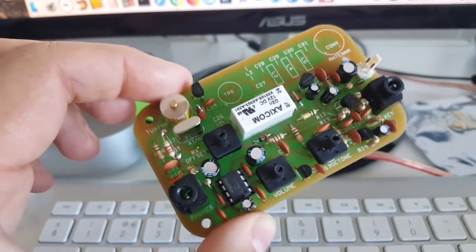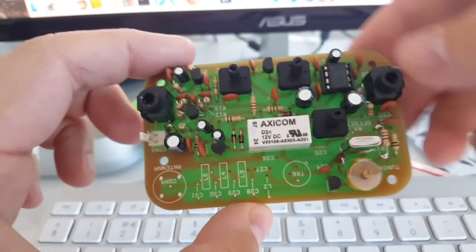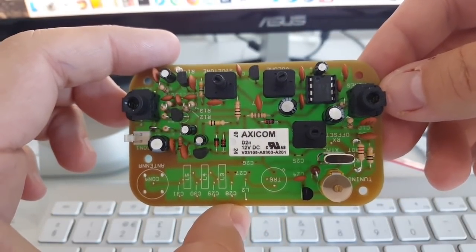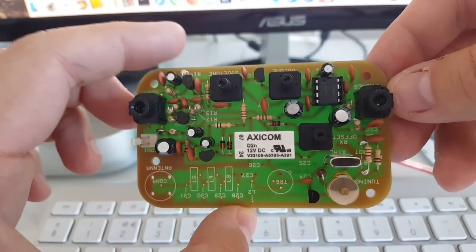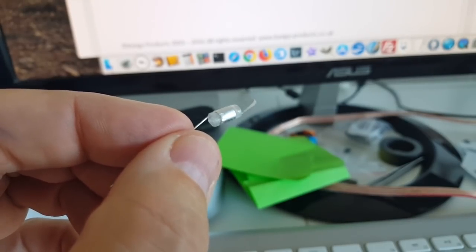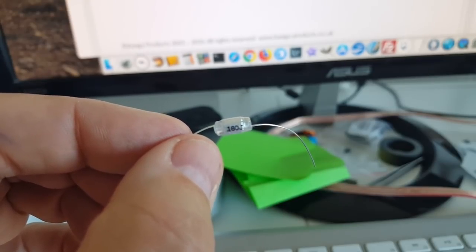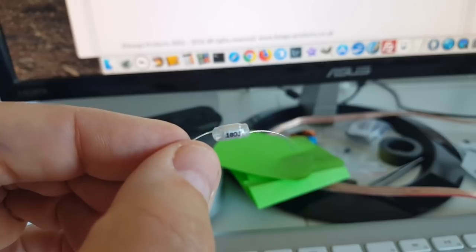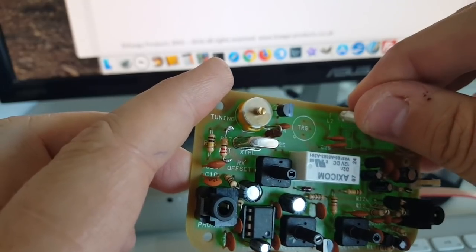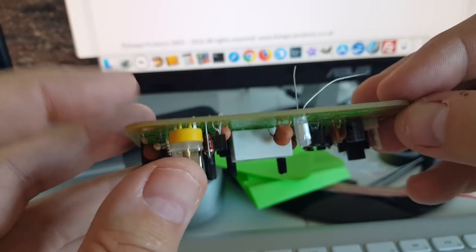The oscillator parts are in. I'm not going to test it right now because I'm in a hurry — I know I shouldn't do that — but I'll move on to stage 5, the power amplifier and filter. When you're soldering polystyrene capacitors you have to be really quick, simply because they can burn up if you heat them too long, but they are more stable than ceramic capacitors. My vision is starting to go — that's a pain. Let's solder it.